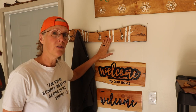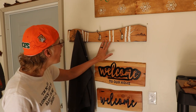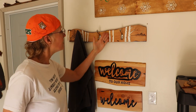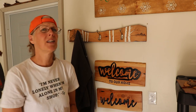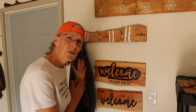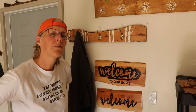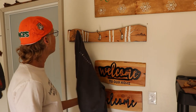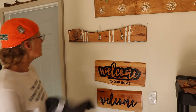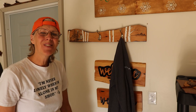So with this project I learned that colored pencil works great but it dissolves away with Old Masters finish. So make sure that your finish and your colored pencil are compatible — I didn't, and it dissolved away, and then my birch trees weren't white anymore, they were just the color of the juniper. But good old acrylic paint and wood burning back over the top of it works great. Painting first and then wood burning seems to be better than wood burning and then trying to paint over the top of that, so I will probably paint first and wood burn second from now on. I added the hooks to make it a coat rack, but I could have left it without the hooks and just made it a pretty piece of art — which I like because I really like birch trees. Thanks for joining me everyone, we'll see you next time. Bye!